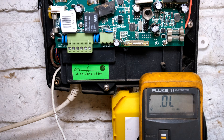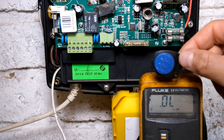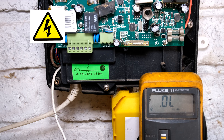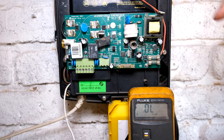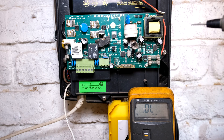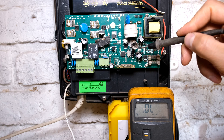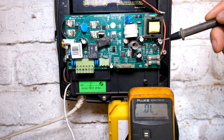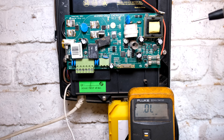When you switch on your energizer, you will either be switching it on from a remote control or you'll be using one of these magnetic disks. If yours is not operating, it's just because this button has to be depressed and you can override it by putting a jumper on this terminal over here, just allowing me to work with the energizer while the cover is open.